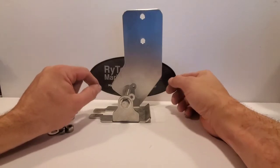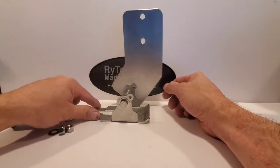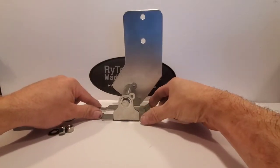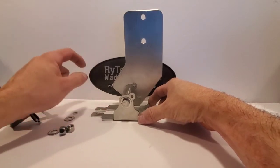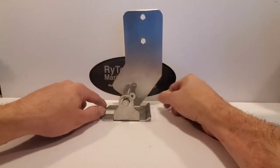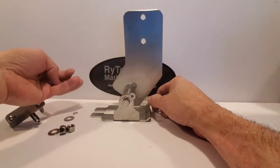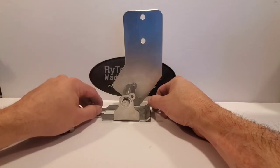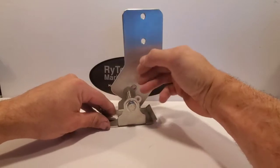Usually, because of the jackplate, you're never going to hit anything with the actual transducer because it's up out of the water. But one thing that a lot of guys don't think about is at the boat ramp, you're back around the motor, pulling your transom saver off or whatnot, and you actually bump the transducer. You could deflect that a little bit, and then you're struggling the whole day because your images are off and you have no idea why. So that's one thing about being able to lock the lower bracket to the upper bracket.